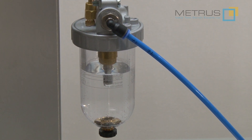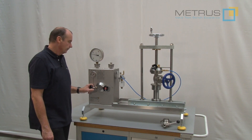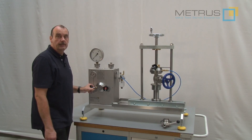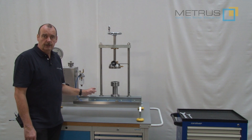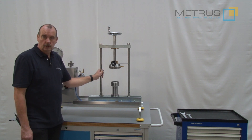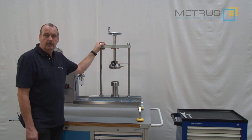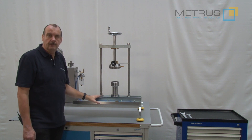Check if there is a leakage on the bubble counter. In our case this shut-off valve is not sealing properly. Release the pressure and the test is done. When you have finished your tests with shut-off or control valves, you can remove the head beam within a few minutes and continue working with your valve test bench for testing safety relief valves.